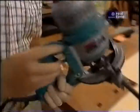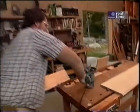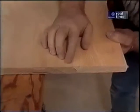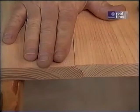I'm going to run it through my sample before I make any commitment to the finished leaves. Now I'll take my sample and bring it over to my finished top and check the fit. It's a little bit too high right here, so I'm going to have to make a couple more adjustments to the router, try it on my sample, and then I'll do the real leaves.